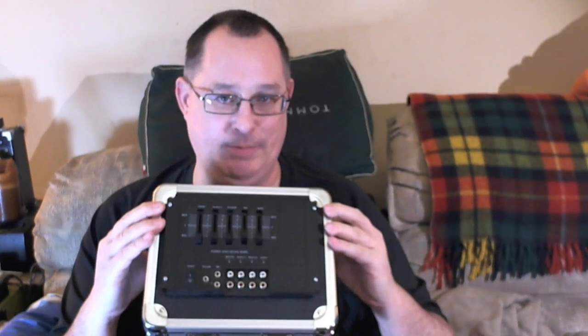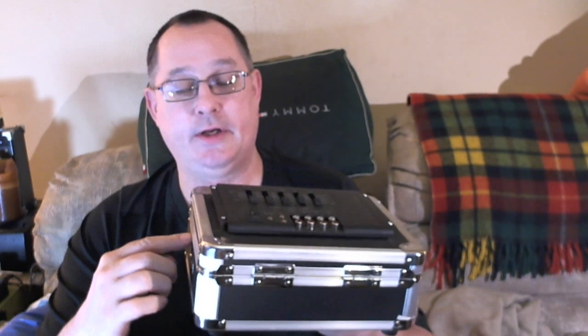So how that will work is this unit here is going to go in here. I have a Velcro to keep the remote up here, and then there's going to be two input jacks, one on each side. They're going to be stereo input jacks, quarter inch or 6.5 millimeter. My wife has a bass guitar processor that has an amp and cabinet simulator with that stereo headphone jack style output. So her signal will come in stereo to here.